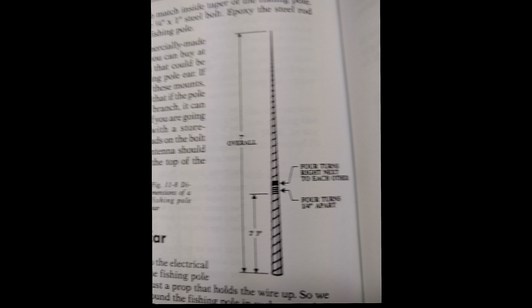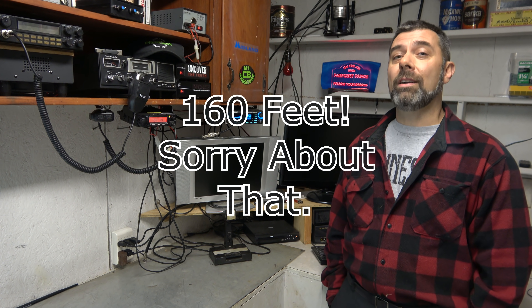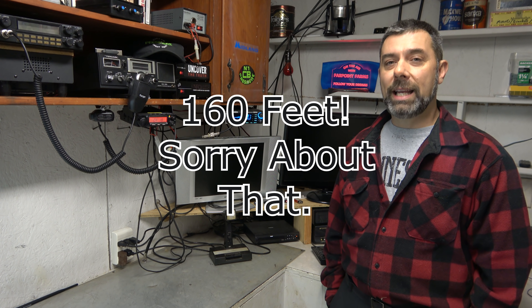There are other types. If you want to use a mobile antenna, here's a picture of what's called a fishing pole antenna — this particular one being seven feet long. All it is is a wire wound around a seven-foot antenna. The idea is we are working on wavelengths. A quarter wavelength is 108 inches long. In order to take a seven-foot antenna, you have to somehow make the entire nine-foot antenna and shrink it down to seven feet. You do so by coiling it.